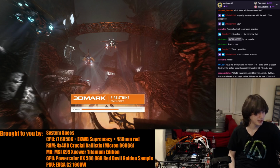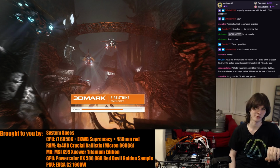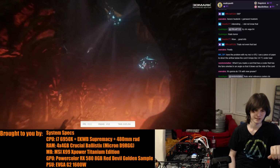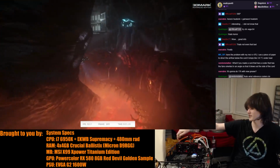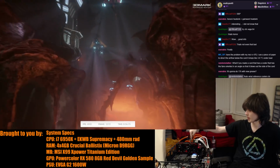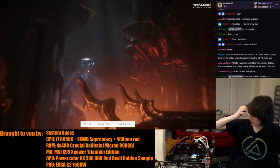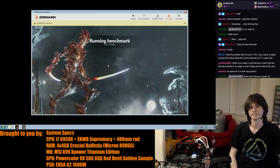So, fans oriented at an angle. If you orient the fans at an angle, you lose fin stack surface area. That's the problem. There's not really a good way of doing a GPU heatsink. Though I will say that if you know what you're doing with your case airflow, the best performance is always going to be the cards that exhaust up from the top edge here. That's the best place to exhaust, because I did mention that they build up heat, like hot air by the PCIe slot. But as long as you have a fan blowing air across this area, that won't actually be a problem. So yeah.